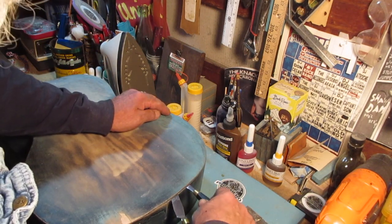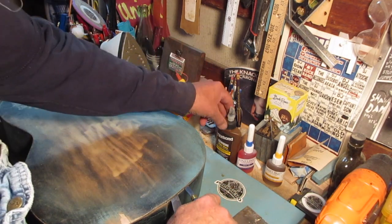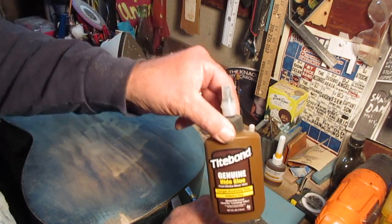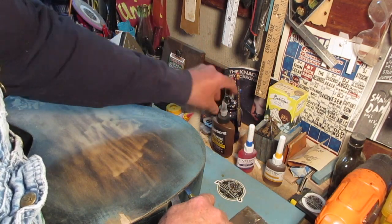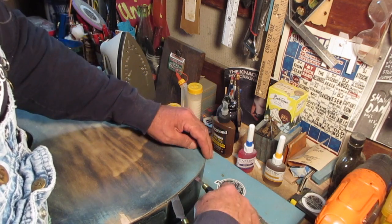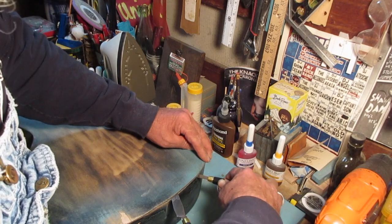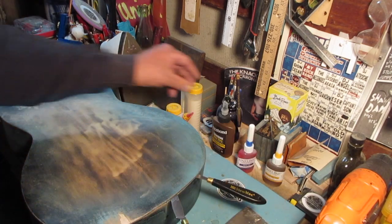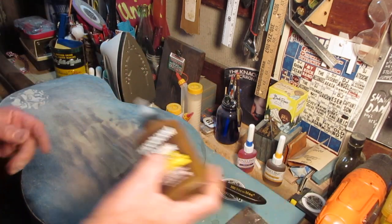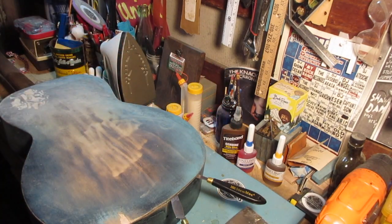And guess what it's going to do? That's right, because it's hot and hide glue does what? Heat activated. This is going to cut loose. And then I can find out where I need to put the glue, you see. Ooh, right there. It's all right there. Then I can pop that in there, and then we can just do this, right? Wrong. Time for my next little trick.